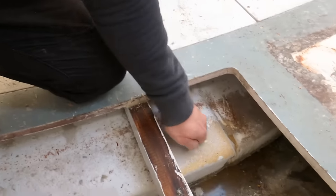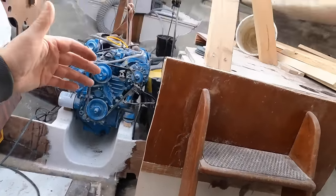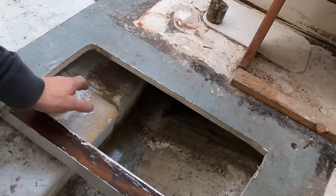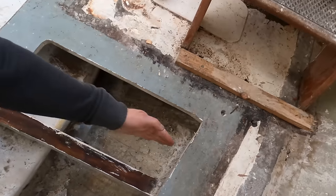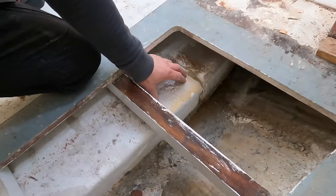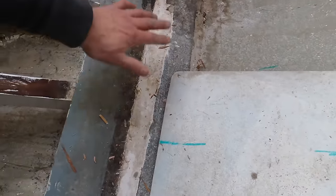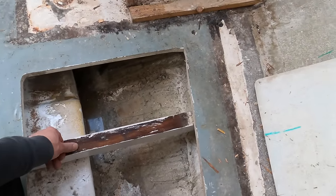This is the iron keel, and it stretches from the bow all the way back to almost the sump behind the engine. I could make this template attached to this — would it make the hull stronger or will it make noise? I guess the hull is quite stiff down here due to this, so it has to be the structure. The structure on this is not very important because it already has the floor, which is one structure. The only advantage to go below this area is that one might have the possibility to make a watertight bulkhead.